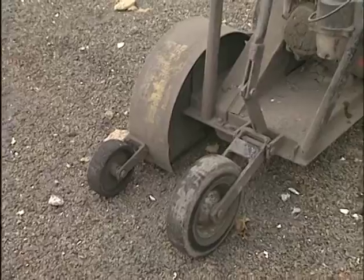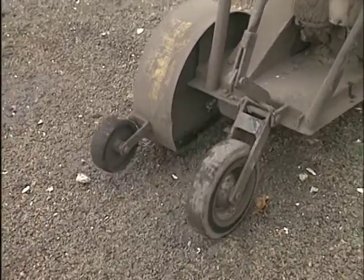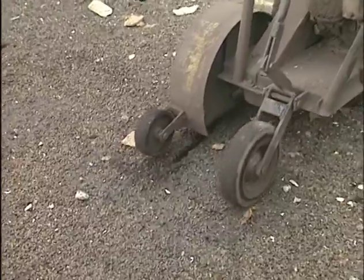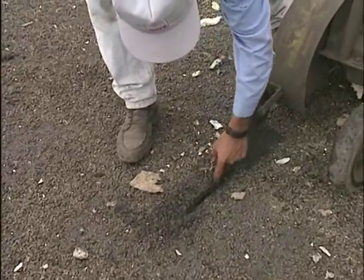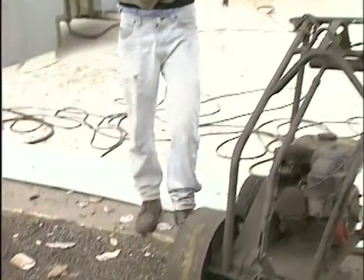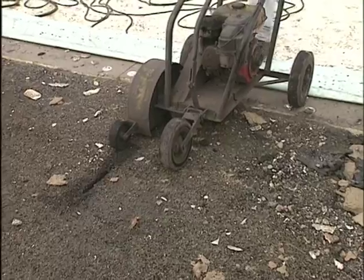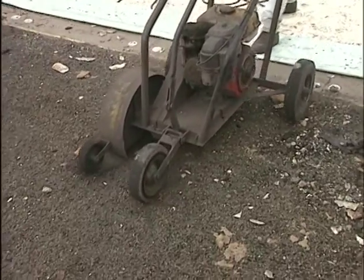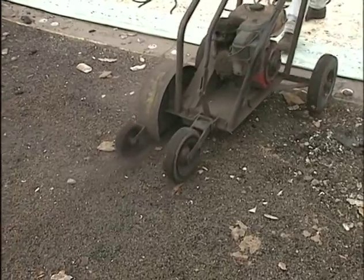It has to cut through all of the old layers of roofing, yet avoid slicing into the deck itself. The old roof system may also have a tapered insulation, requiring changing the cutting depth in different areas. If the old system is excessively thick, it may require multiple cuts at more shallow depths. You'll learn how to adjust this setting during your in-shop and on-the-job training.